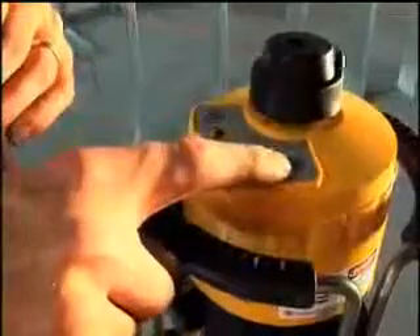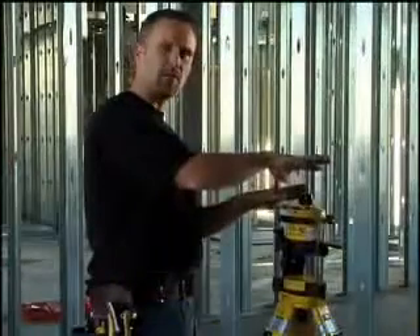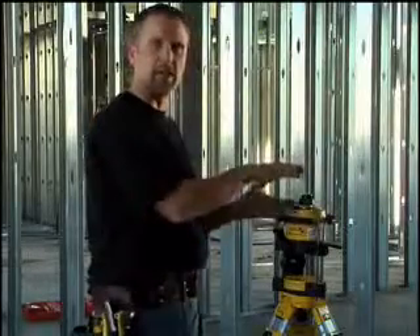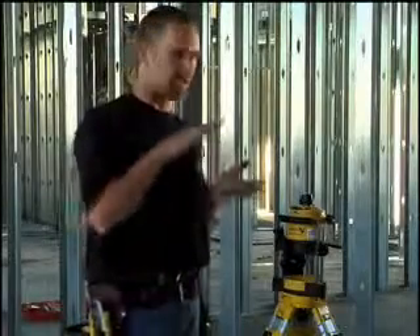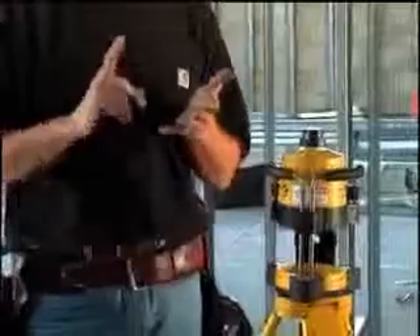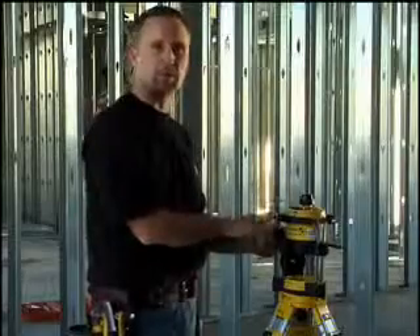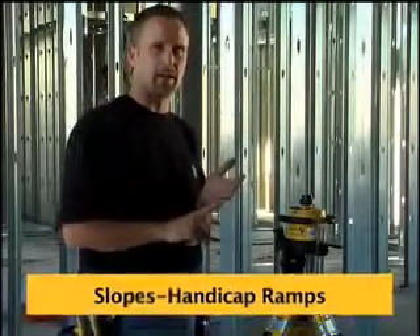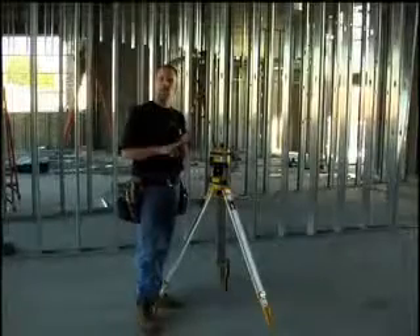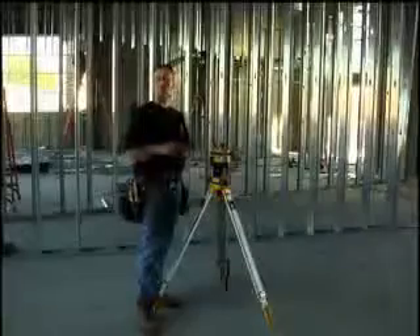The last button is the Z button, which does incline. This laser is designed to do incline off of one axis — it'll tilt down five degrees or up five degrees for a total of 10 degrees. Five degrees is equal to 1:12, which means a drop of one inch over 12 inches, which happens to be the same as the code for a handicap ramp. This laser is designed for commercial job sites, and every store, school, hotel, and public place has to be ADA compliant — American Disabilities Act — and the code for handicap ramps is it can't exceed 1:12. This laser does five degrees or 1:12 on incline, so it's great for doing handicap ramps.